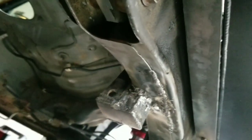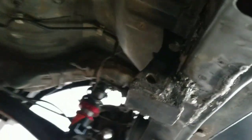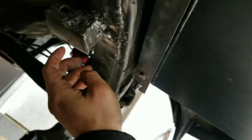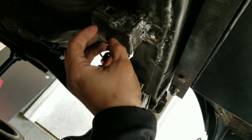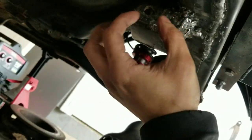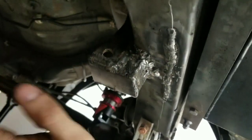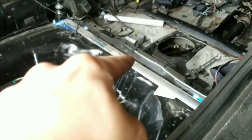It's up in there welded in. I still need to finish the top welds and do the other side, then the rear bracket is done. I might add a bar in the bottom and get longer bolts — a long bolt that goes through square tubing connecting both sides to eliminate some of that side motion. The top mount will still need to be done, and I need to get a plate for the top.